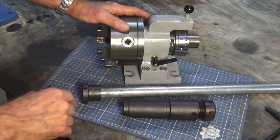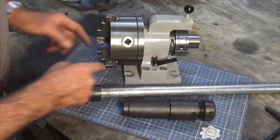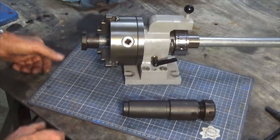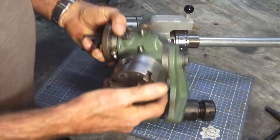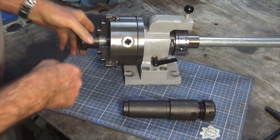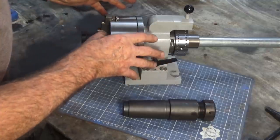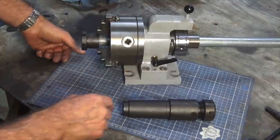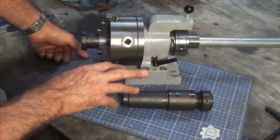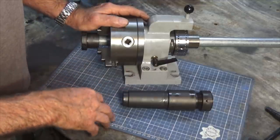And this little piece of kit here — the spin indexer — once again, was done because at the time I didn't have the budget to buy a spin indexer, but also it has that big advantage of being able to pass a large diameter of parts right through the centre of the spindle. And although I've got another indexing head — a little Hercus one, it's a beautiful little tool — it doesn't have that capacity to pass long parts right through the centre of the bore. So once again, that fulfilled a need that I had, and there was nothing I could afford to buy on the budget I had to do that job. That's it for today's video — thanks for hanging out. I've got two interesting videos coming up in the next couple of weeks. It's Prezzo signing out for now — thanks for joining me today, and I'll catch you on the next video.